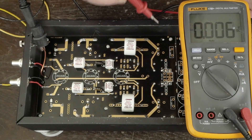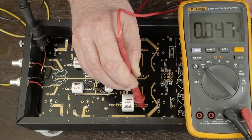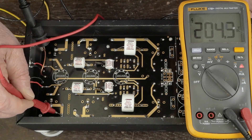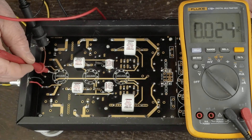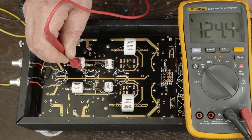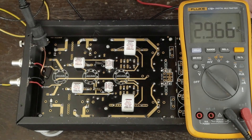That was definitely an obvious problem we found — let's check our voltages again. Got 300, 296, 296, 280, 280, 204, 206. Definitely fixed the problem. Let's run down these plates: 86, 81, 124, 120, 296, 296. All that looks lovely.